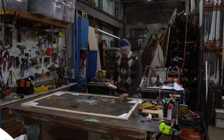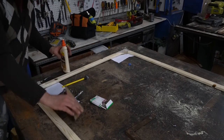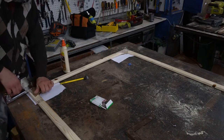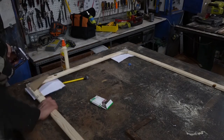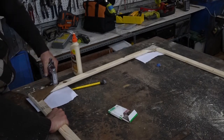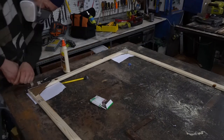One important difference for this side is that we are going to build a little tension into the frame. I put extra glue on there and smeared it around. Now watch what I do here — I'm going to force the two pieces of wood together by turning the 59 inch piece in towards the center of the frame. One more time in slow motion: I force together this joint before stapling it. That's holding those two pieces of wood together and providing a lot of strength. There is a tension built in there that's going to dry into the glue. Plenty of staples — these act as clamps, holding the two surfaces together wherever you staple.